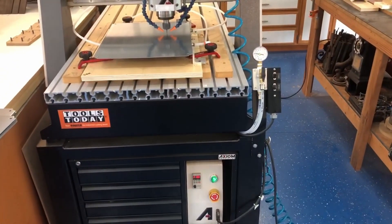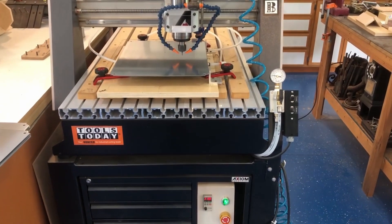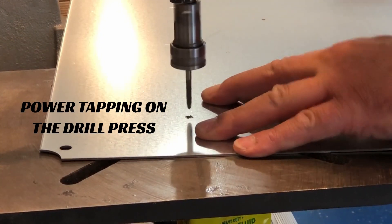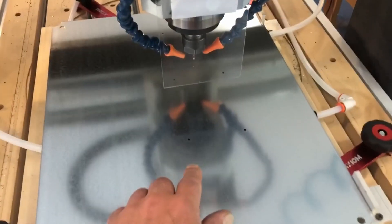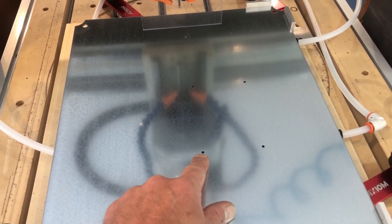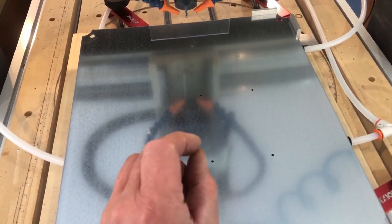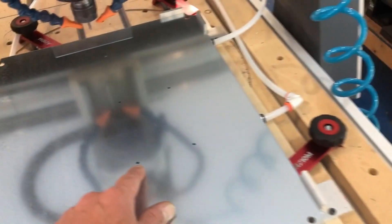Now I should tell you those holes are 0.156 diameter — that's a little bit bigger than an eighth of an inch — and then they're going to be tapped for an 8-32 screw. All of these plates need to be the same, so I thought I'd try it with the CNC. That worked pretty well. The only thing I could hear is that when it breaks through the bottom of the hole, it spins around once on the last finish pass, and I hear just a tiny bit of chatter, and that all seems to be related to the speed I'm running at.